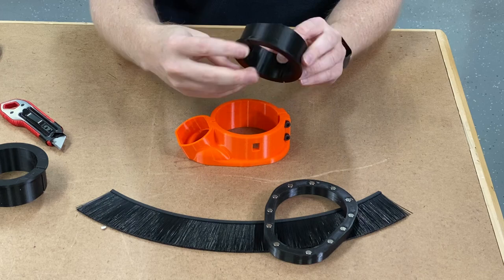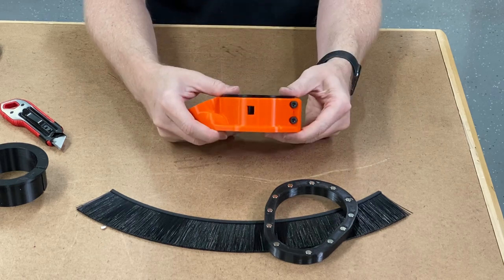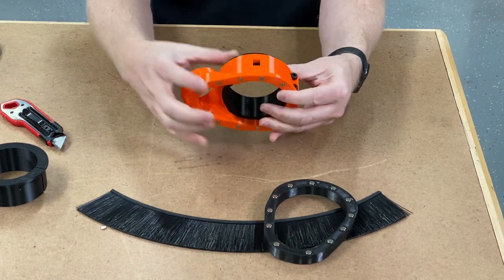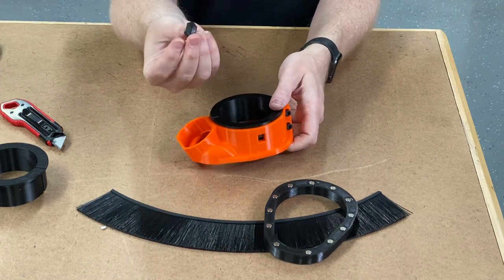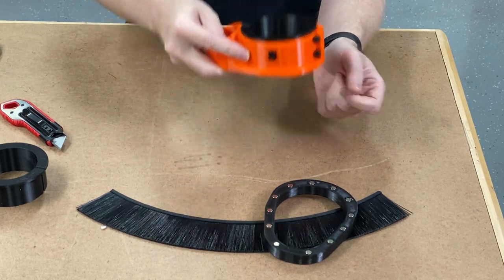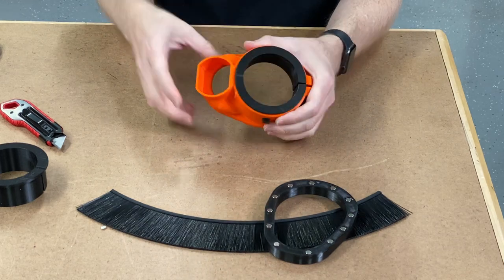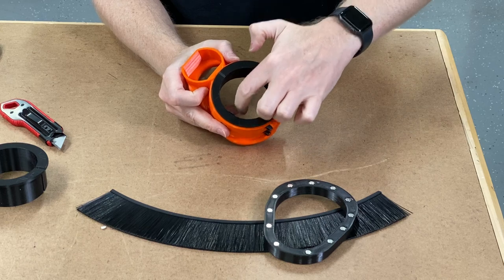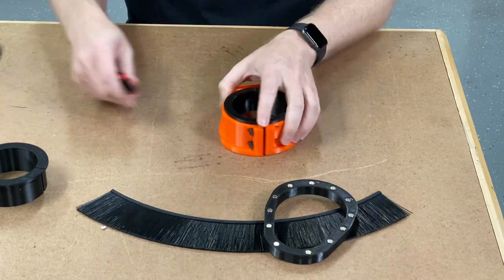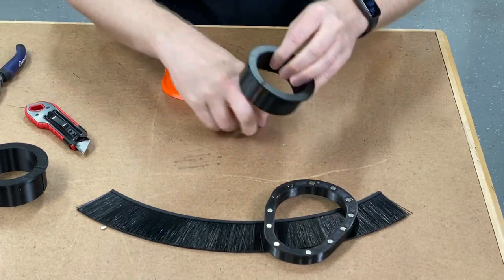With the 69 millimeter or DeWalt collar, when you drop that into place make sure it's lined up — there's a little marker here which lets you see it from the top, but the hole should line up perfectly. What you're going to do is take your button and just slide it in there and leave it in there, because whenever you go to install your boot on your spindle, that button needs to be in place from the inside. That way, when you push it, it activates the button on your router in order to grab the chuck.